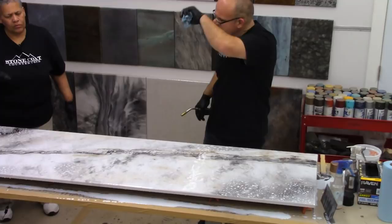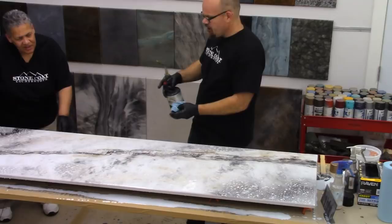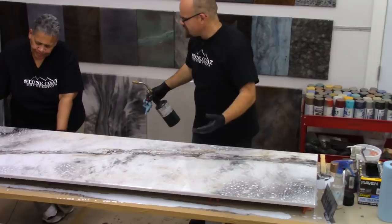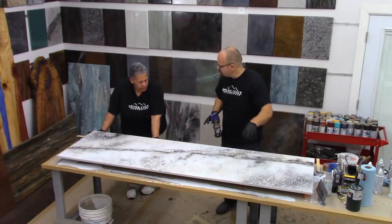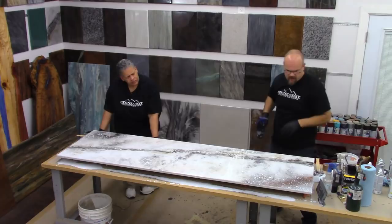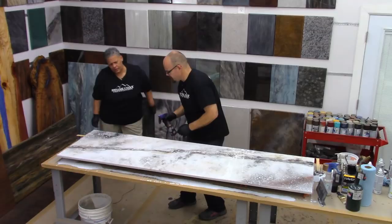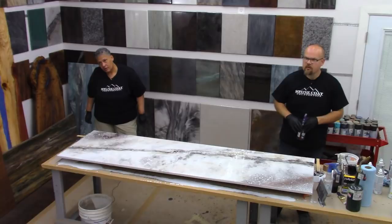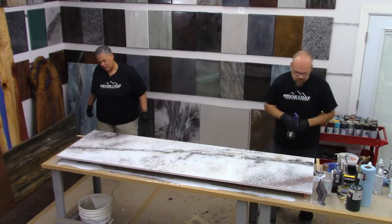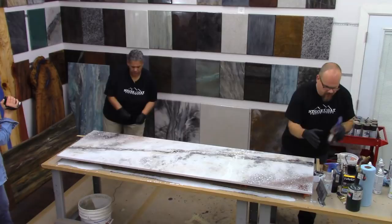When you put your top coat on, that's it. Now, let's say you hated this and couldn't live with it — you can do another color coat right over the top and then do a clear over that. You're not limited to just the two coats, but we don't want you getting more epoxy than necessary. I want to add just a touch of bronze metallic to give it a little bit more color and overlap these areas that we've already granified. I'll start right here, hit a little bit of bronze, let that move, and see what I think. Now we've really layered some color here. Let's torch this out and really move that around. See what it does when you torch it — you've got a lot of color and it starts to look like exotic stone where it all melds and matches.